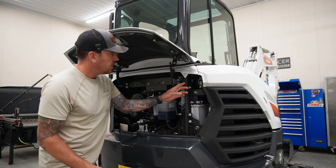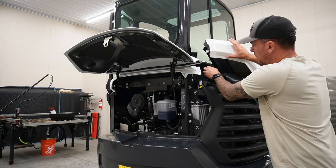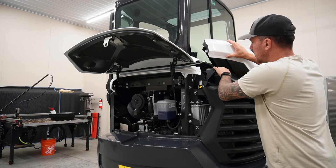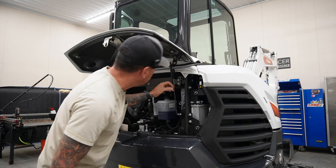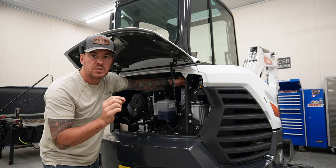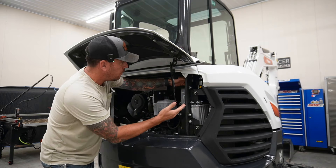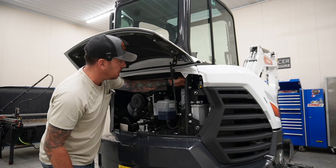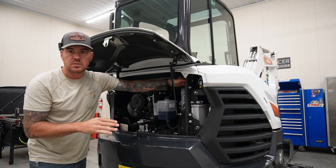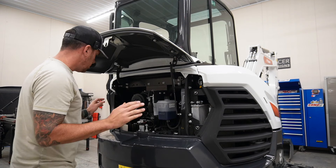Quick side note: the latch on this side cover is mounted to a bracket. When I was wiping the dirt off I noticed it moved a little bit. On the other side, I checked the nuts on the carriage bolts and both were just a little bit loose — eventually they would have vibrated off and I would have lost that bracket. It confirms why you need to pay attention when doing your services: always do a visual, be looking for other little items.